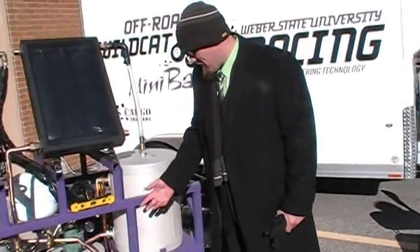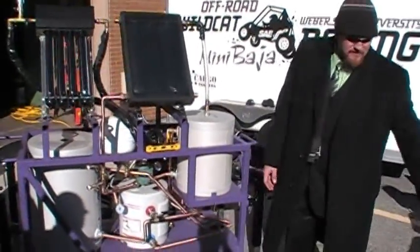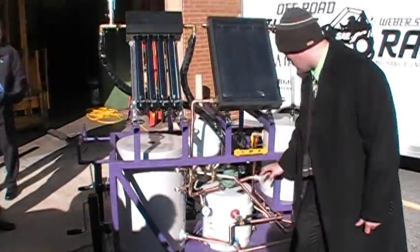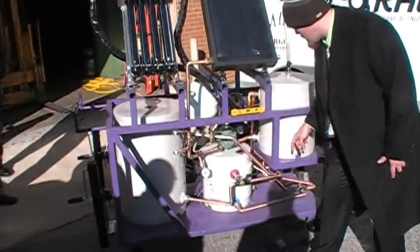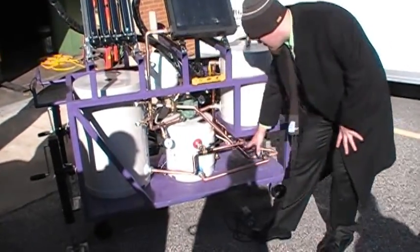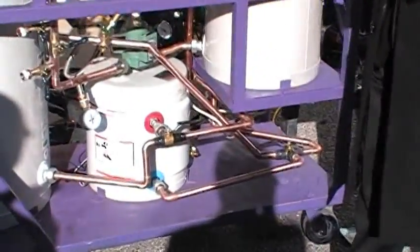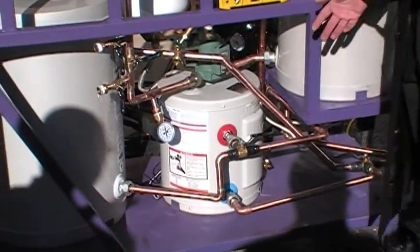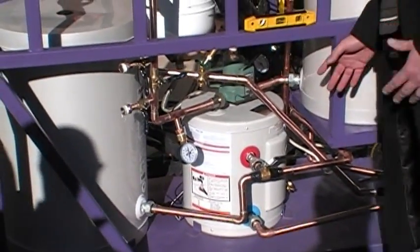I wanted to show you a little bit about what we actually found here, or what's going on here. This system is completely separate. It runs and uses this tank. They share a potable water supply through the hot water heater, that tank, and there's a coil inside this tank. That's all the same water system, and that's all in this plumbing. This plumbing here isn't going to be pressurized. We had a pump here that we removed, thinking that we were going to be able to hook the hose up and get the water to flow as it heated. Now we're thinking we probably should have rerouted it completely differently, but it's working now and we'll be able to show you how it all works.